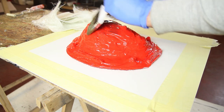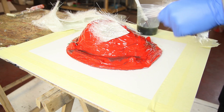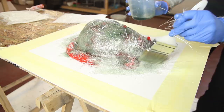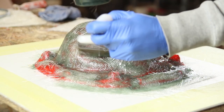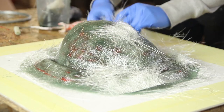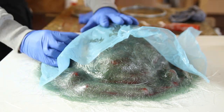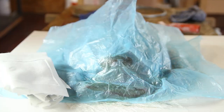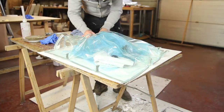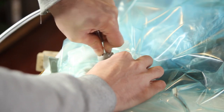I just apply a first layer onto the silicone. You don't need release agents because silicone self-releases from any material except silicone itself — if you pour silicone on silicone, it will adhere. Fiberglass and polyester will not stick to silicone. Then I add some chopped strand fiberglass, which is very easy to apply. The binder and chopped fibers will loosen over time with the polyester resin added. I was also trying adding vacuum to compress the fiberglass against the silicone — though after making this tutorial, I found this step isn't necessary.